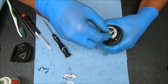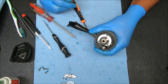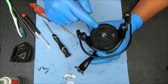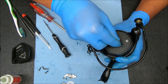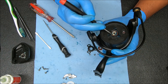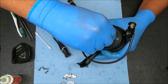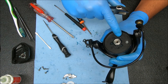You can go ahead and add that O-ring around the top of this, and now you're looking good. Now we're going to take our rotor, drop that over it, and rotate until it goes through the slot — because this is keyed as well. Now we're going to secure it. The first thing we're going to put on would be this O-ring here — that's the top one. We want to make sure it's flush inside that channel it should be in. Now we're going to take the nut and secure it. I want to get either the flat sides or one of those points on the nut to be around the hole.